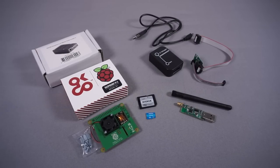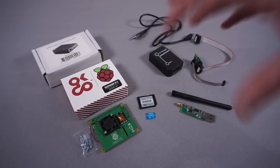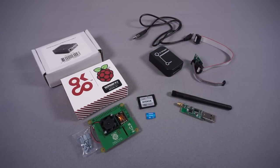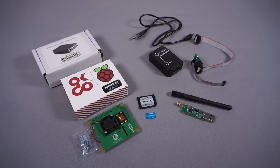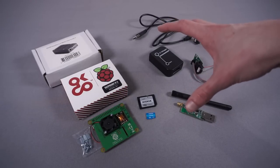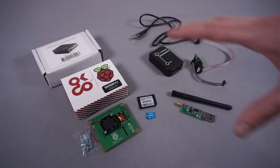You can run this on really any computer — I've tried it briefly on a laptop and it works fine — but I'm just going to use a Raspberry Pi. I'll be building a little Zigbee2MQTT bridge device using a Pi. While I could also run Node-RED and everything on the Pi, my plan is to keep it separate: I'll run Node-RED on my server, and build almost the most appliance-like bridge I can — a totally set-and-forget solution that I can build up, plug in, and never really need to go in and maintain again.